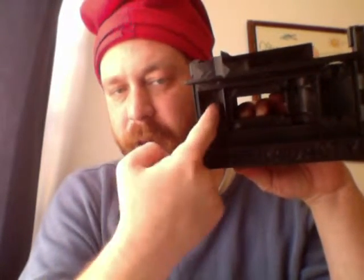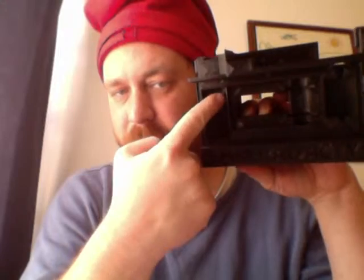I would never use Plasti-Dip on something like this chamber or anything where there's motion, right? Friction between two objects. It rubs off really easily. And what's more is when it rubs off, you get these little rubber-like boogers that will gum up mechanisms. So Plasti-Dip is great for light proofing because it will sort of seep and coat through layers and things like that. And it's a light-tight black paint.